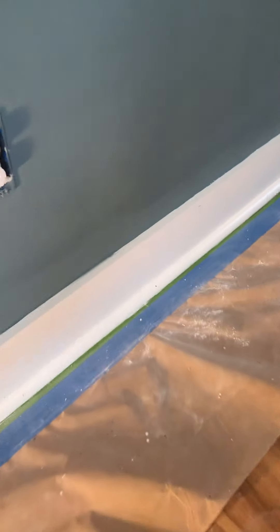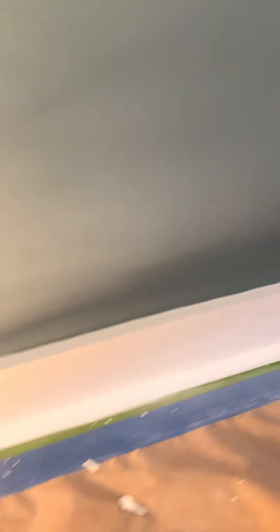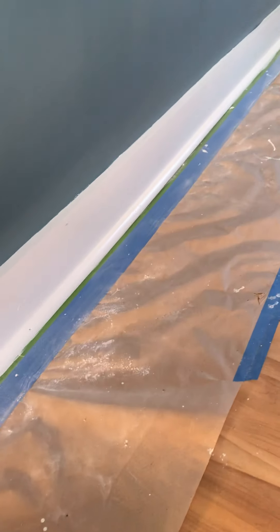I'm just going to go around — there's only one coat on the baseboard, I gotta do a second coat. I roll my walls out first and then do my second coat, that way when I cut in it's much easier to just cut up on the wall a little tiny bit — gives you a nice straight line all the way down. This cashmere goes on great, I just rolled this half hour ago. It's a real silky smooth paint. I like it. I have no problem with it even on trim.